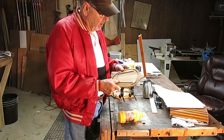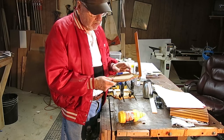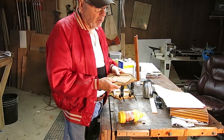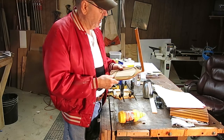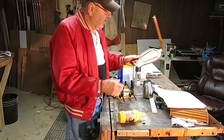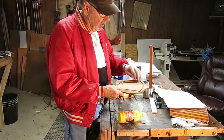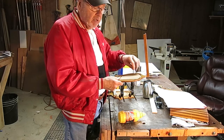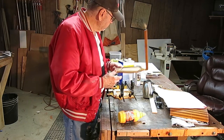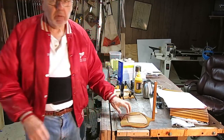Glue requires three things to make a good glue joint: plenty of glue, a clean surface, and pressure. That's all — well, four things: time to set up. Anyway, this is setting up, and in the meantime I'm going to take the other piece, put a piece of tape over it, and draw all the lines in there as a pattern and route out that area. I'm going to get a piece of masking tape and draw me a pattern. When making a pattern, I like the old cheap stuff, not the blue tape — the reason is it's thinner and it's easier to get a good line.